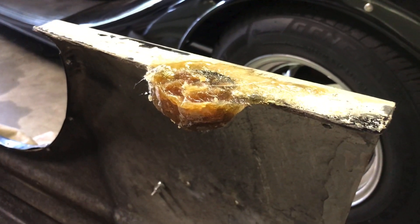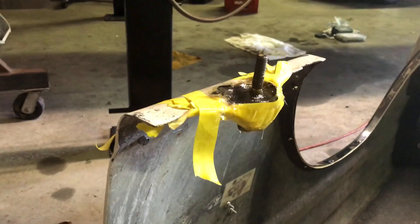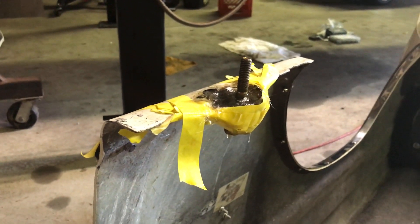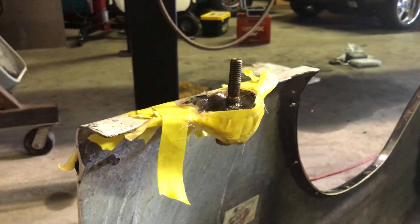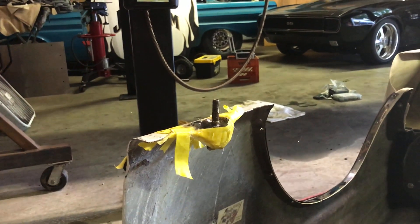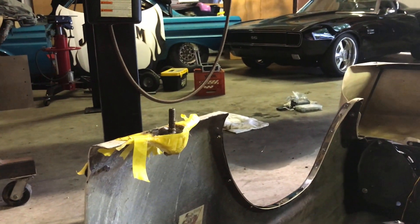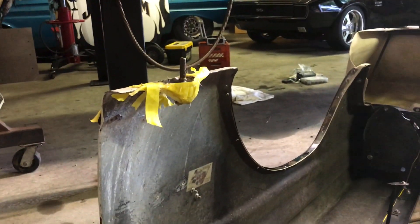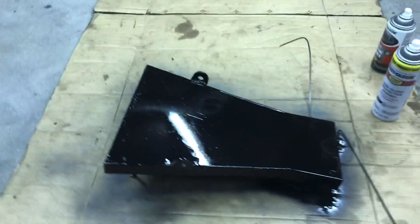That one's done, all roughed out. I'm going to get it smooth when I'm done — it's getting hard now. In a couple minutes I'll take the tape off and take the bolt out, and I'll be left with a 3/8 hole for a 5/16 bolt that has to go in there, so I have enough room to play around with it. Then primer and paint it — all the brackets are welded on and ready to go. We'll put it on tomorrow.